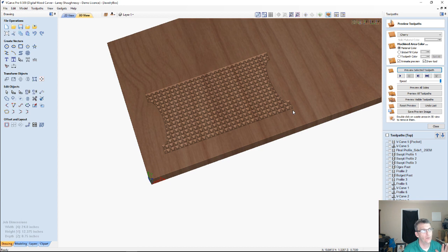I'm going to give you the Vectric files as well as the toolpath files in the Vectric. They'll be all ready and renamed properly. All you have to do is change names or textures or designs. Just recalculate your toolpaths if you make any changes, of course, and you should always look at the toolpaths. Never take a toolpath for granted. Always look at it and make changes.